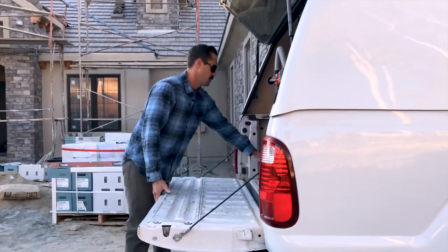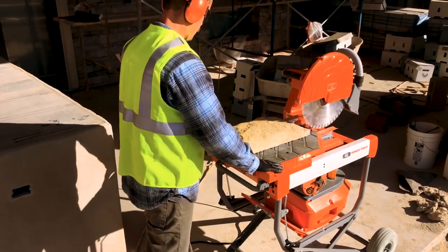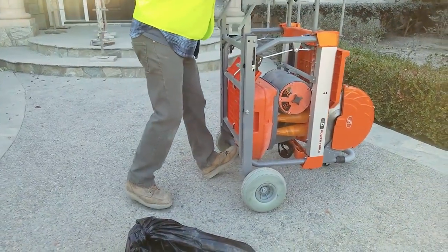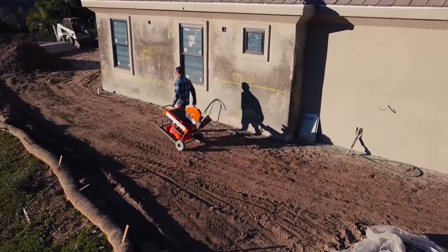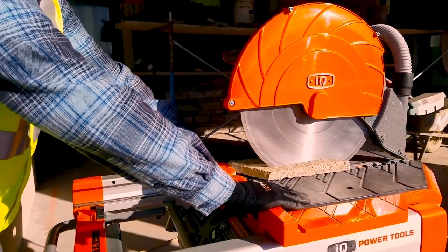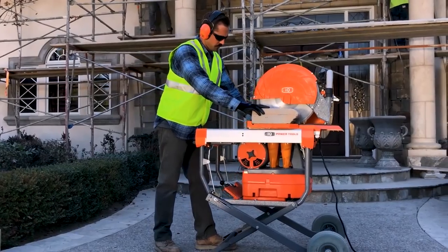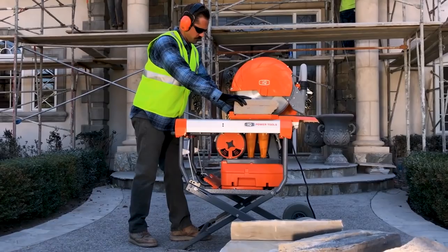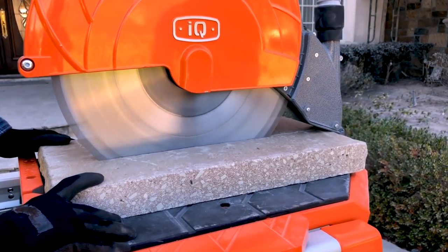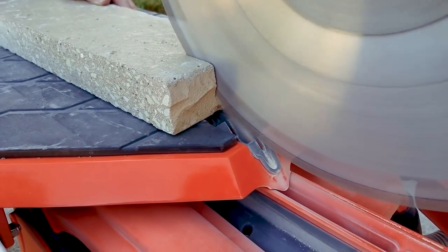A powerful electric motor rotates a 16-inch replaceable disc saw. The depth of the cut is 5.5 inches and the length of the stroke is 24 inches. The feed of the workpiece is carried out with the help of a rack mount carriage with an anti-slip coating. The waste collection container is located under the saw unit. It is hermetically sealed and can separate shavings from sawdust by the size of the fraction for subsequent use or disposal. The dust collection system captures 99.5% of all waste.